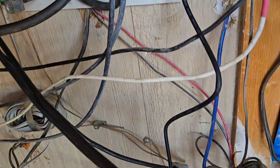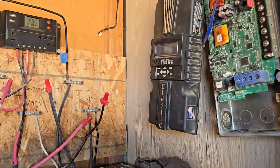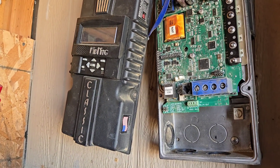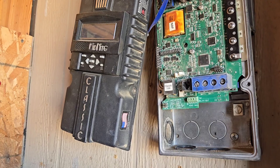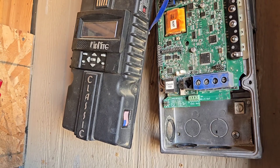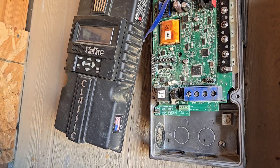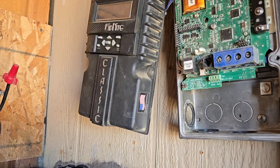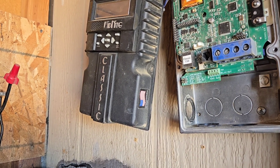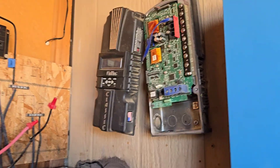The Rover is still working and I didn't disconnect it, but the Midnight Classic is disconnected — no wires in it. I'm going to experiment with it on my turbine to see if my turbine will put enough electricity out to charge a 48 volt system. If it does and it goes through there, I can control it so it doesn't fluctuate and cause the batteries to go nuts on the BMS with power surges — those power surges from the turbine will shut down the BMS, which kind of defeats the whole purpose.